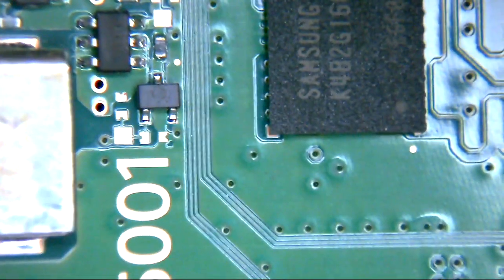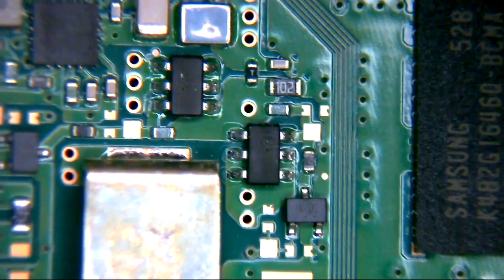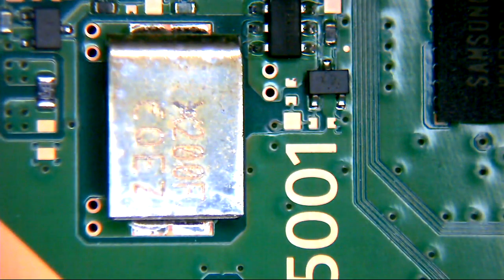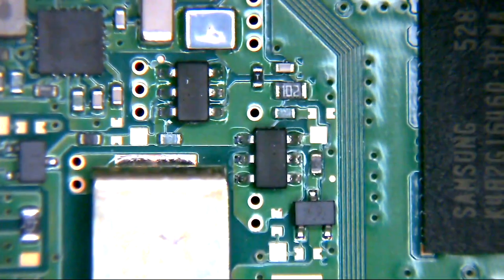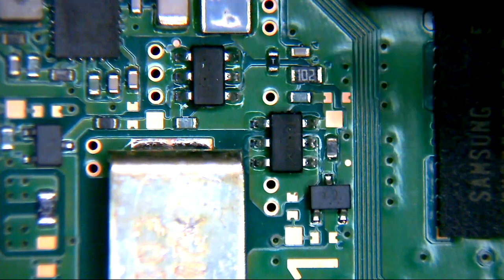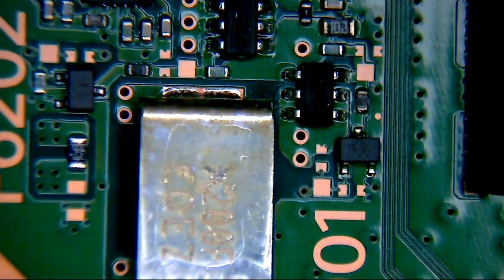Okay, so let's have a wander out onto our actual mainboard. So that's our Southbridge, where we suspect that the functionality for signalling is actually held within. There's these two. There's also that big thing there, which is carried over from the previous board. There's also another fuse there. If you take a look, there's two transistor packages there. So what about those two then? Those look familiar, don't they? You've got those two transistor packages, few resistors located around there. It's very close by to our Southbridge.